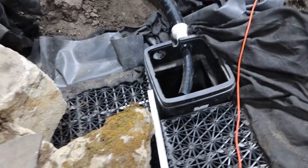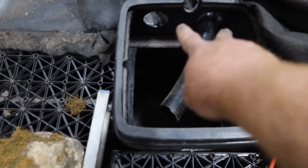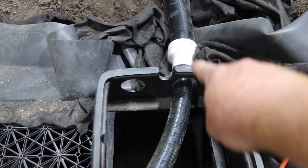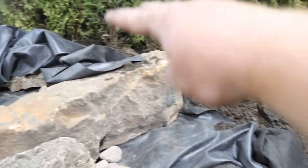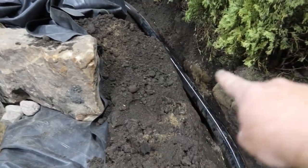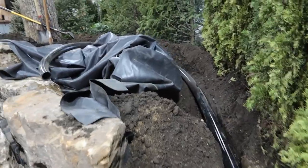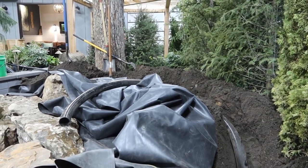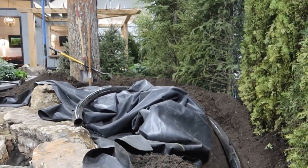We're running the plumbing - remember we're going to do two solid-handling 5-to-9 pumps. Chris has re-drilled out these holes to accept them - the 5-to-9s come with a two-inch discharge so we have a 2-to-3 inch reducer moving to our three-inch line. We've got a trench dug wide enough for two three-inch lines going up to the top. We really wanted to get this plumbing in before we put this other rock in there, and then we can just backfill this and drop one more boulder. Up on top we're going to bring this to two different spillways - we'll go up there and show you something a little different with the spillway, probably different than what you guys typically see or do.